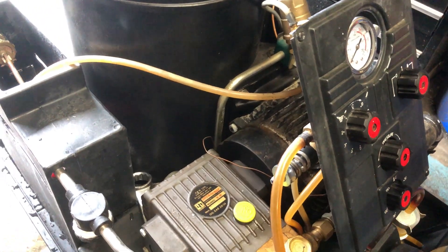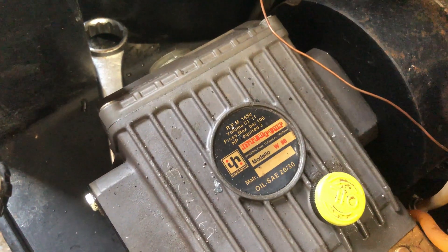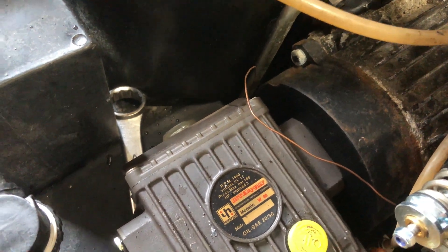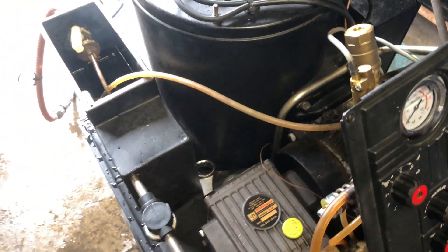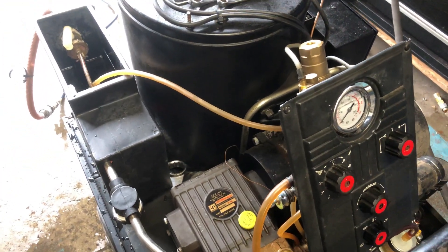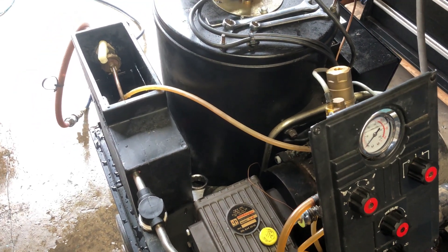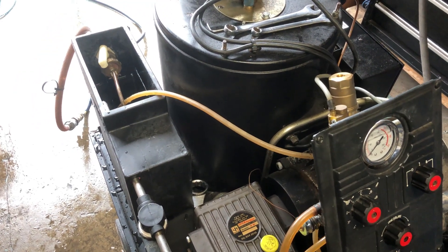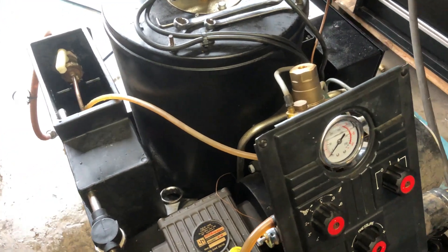The first most important part in setting the unloader up is to make sure that we look at the pump itself - it's a W98, so that machine's 11 litres, 100 bar. So the jet that's going to go into the end of the lance will be the most important part. Setting up any pump, any pressure washer, is the jet size. The jet that's in there at the moment is a 1505 - obviously the angle is the 15, the 5 is the size of it.